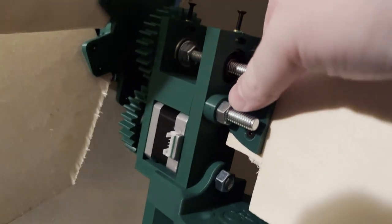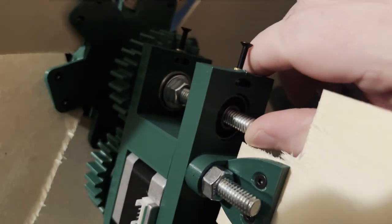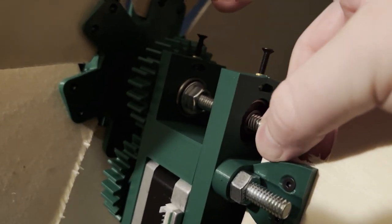The more proper way to fix backlash is by adding a second bearing at the other end of the shaft. This almost acts like a choke for the bolt, preventing it from moving outside of that 8mm diameter even at the extremities.